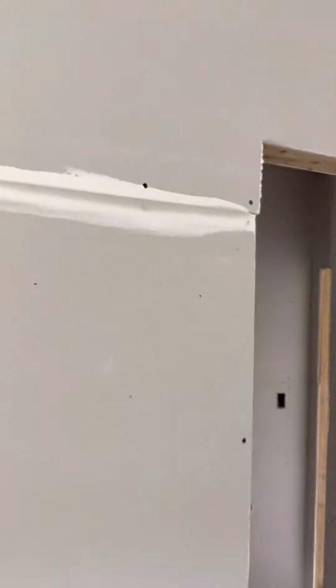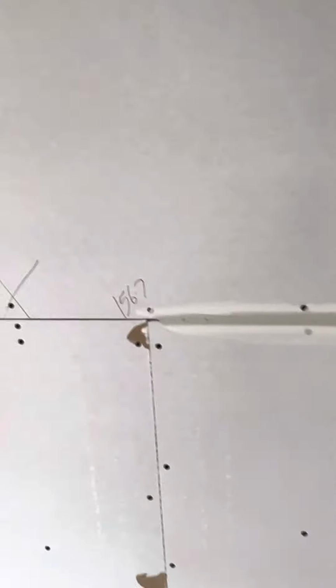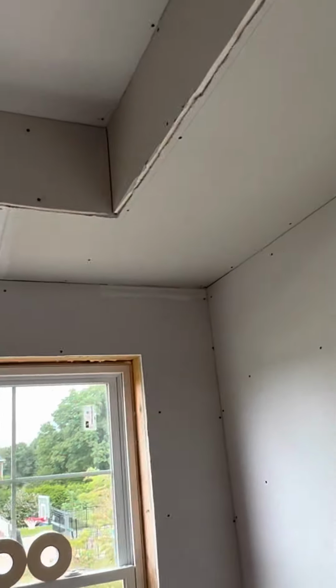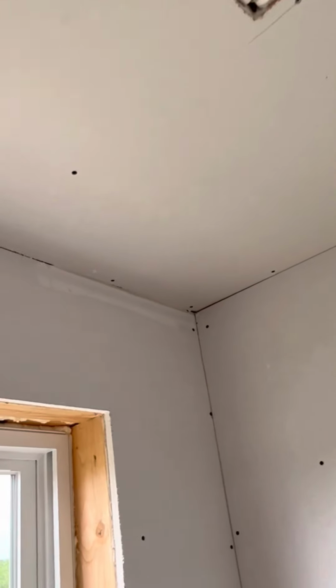This is another reason I'm taping it with a tube. I started yesterday, hand taped a little bit upstairs, and you see I filled these small gaps in the flats. They weren't big, but if they're pre-filled prior to taping with the tube, then what happens is the tape sometimes ridges out in the middle, because the mud squishes in and somehow it pulls back out. But this is a Durabond mud that I'm using. You see, I've got places just about everywhere. I filled corners. Anything that can affect me running these machines and making time.